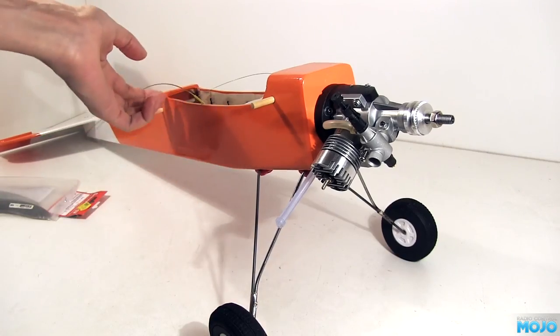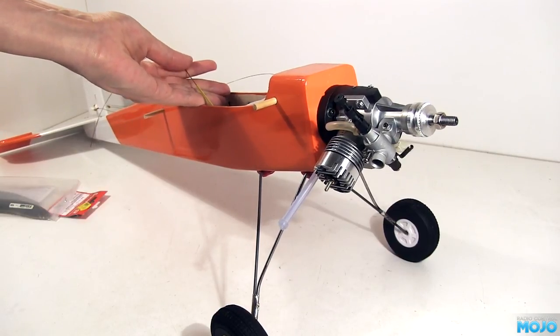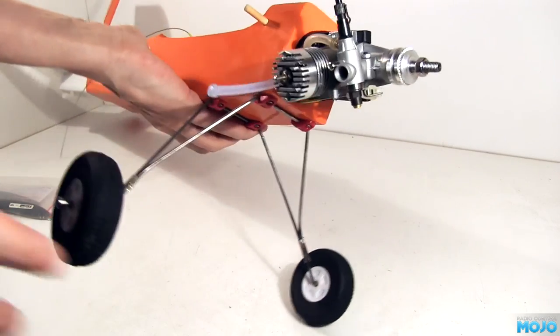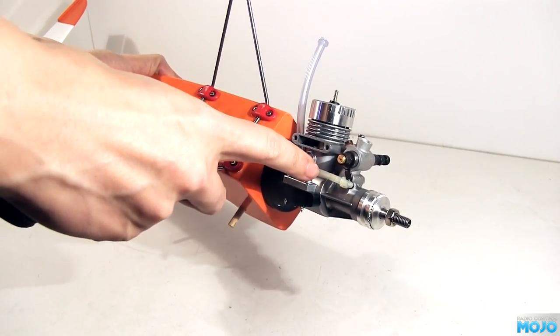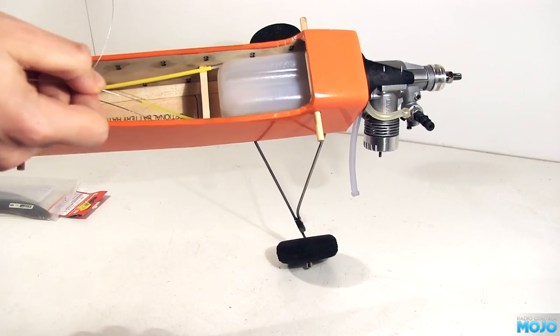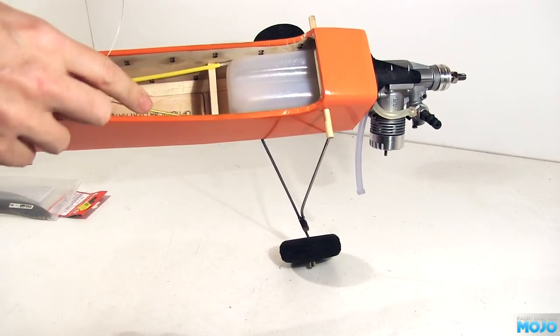I used some good old Sullivan golden cable. Basically a good quality small Bowden cable, a plastic clevis on the carb. I normally use a metal one if the engine's enclosed, as the plastic ones can melt. But on this model, the plastic will be fine. The cable goes under the tank, around the bottom corner, and up the side, and it gives quite a smooth action. Cool. Last bit for tonight, need to refit the exhaust.